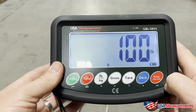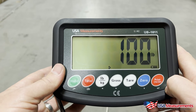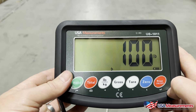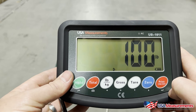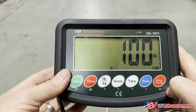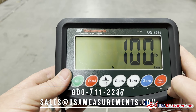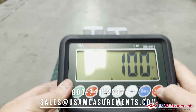That's how you calibrate the indicator. At the last step for F1.7, if when you load the weights on the scale you get an error message like error six, that means you're not using enough calibration weight — just make sure you have more weight to put on your scale. If you have any questions going through the calibration, you're welcome to call our office. Our direct line is 800-711-2237 and you can also email us at sales@usameasurements.com. Thank you for watching.